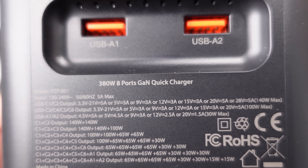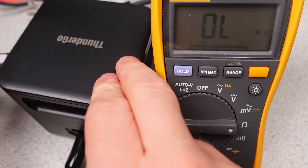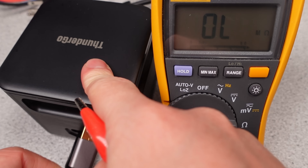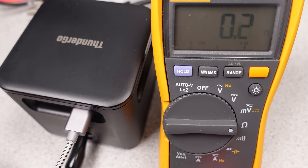This adapter has a three-pin AC mains power connector. Is the third pin connected? The answer is yes — it is directly connected through the USB output pins. This isn't a safety violation, but it's the choice they made. It actually may help in case of a fault in the device. The isolation will be checked later on.